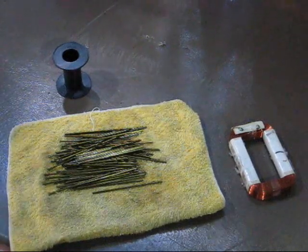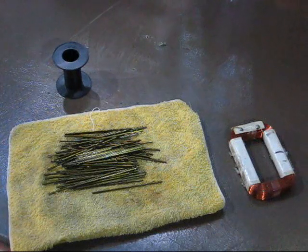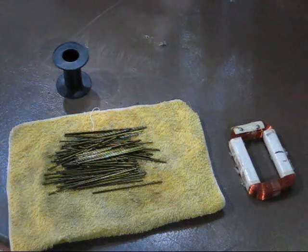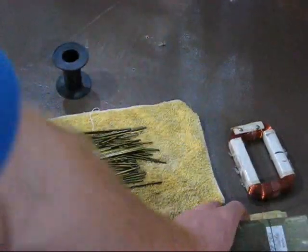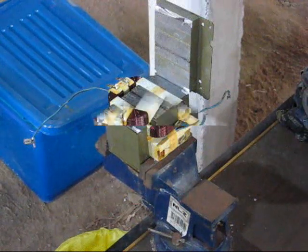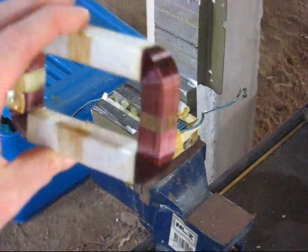Next: magnet wire. A broken microwave oven is a great source for magnet wire. Broken ovens can be found on a curb clearance day, when everybody in your neighborhood is getting rid of all the big stuff. Or you can call an oven repair shop — they'll generally have a number of broken ovens to get rid of. Take the transformer out; it'll look a little like that. This is a transformer before circumcision, and this is one after. Now, chisel the wire out so it looks a little like that — just be careful not to damage the insulation.